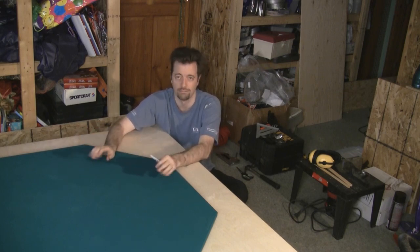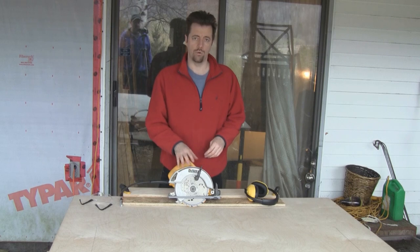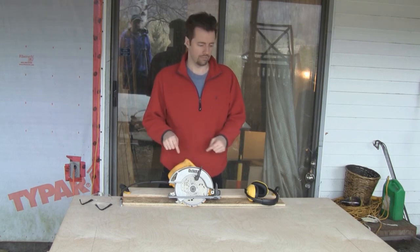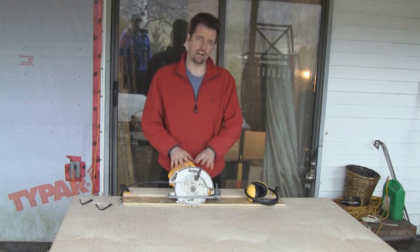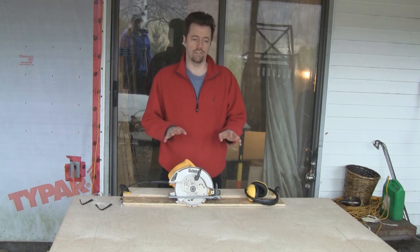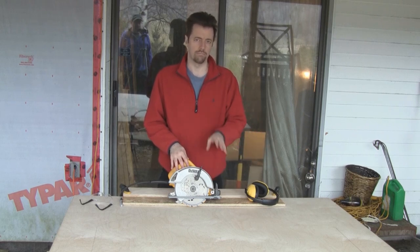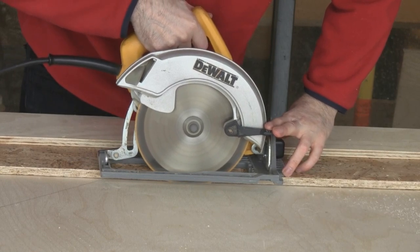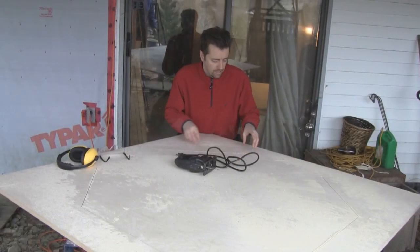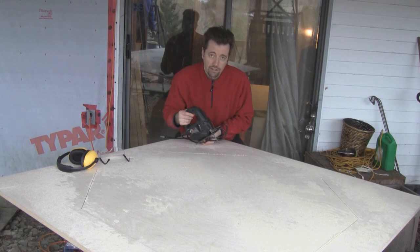Repeat that on four sides and then the center point on the main board will match up with the center points on the center octagon, and then we can trace around this center piece and begin cutting out the center. Once you've traced the octagon it has to go in exactly the same position every time — I've marked a small triangle on this side and on this piece of wood so I know the octagon is always going back in that position. I'm going to use a plunge cut to cut the octagon. The circular saw blade won't go flush right to the inside corner, so I'll cut with a plunge cut to the edges of the lines and then use a jigsaw to finish this off. If you're not comfortable with a plunge cut, drill a hole in each corner and use a jigsaw to cut out the inside — that's a simpler, safer method, although the plunge cut will give you a cleaner edge. The circular saw leaves a little tab in each corner, so you'll still grab a jigsaw and clean that out at the very end.